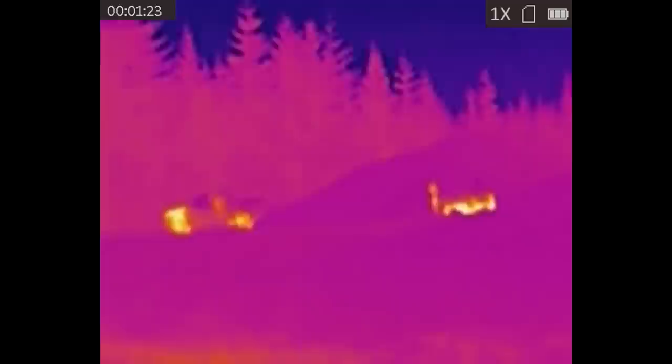If you press the camera button, it will take a picture. If you hold the camera button down for several seconds, it will start recording. The TM-160 doesn't have a built-in microphone, so you get recordings with no sound. The zoom button toggles between two different digital zoom modes and the standard mode. I find that the resolution of the viewfinder is high enough that there's not a lot of benefit to using the digital zoom. That might not be the case on the higher resolution devices.